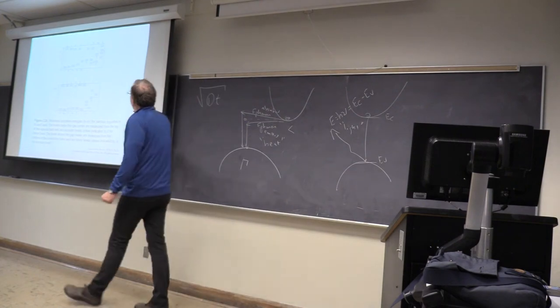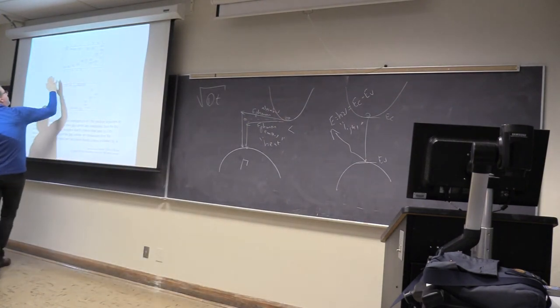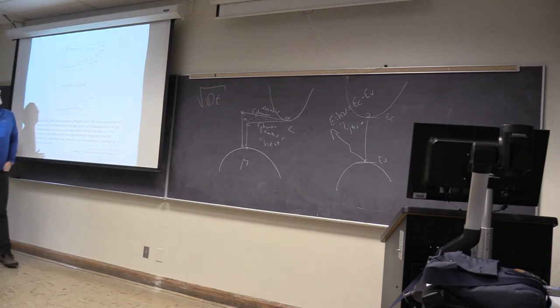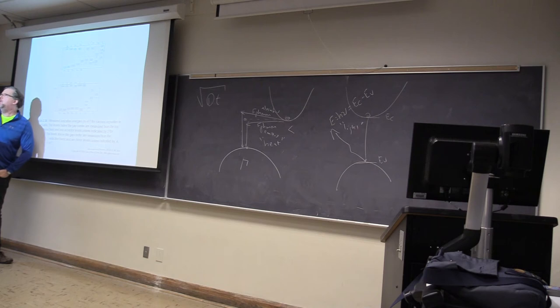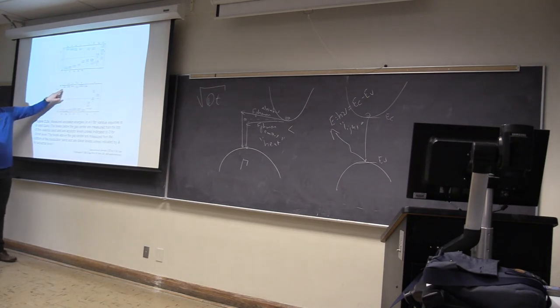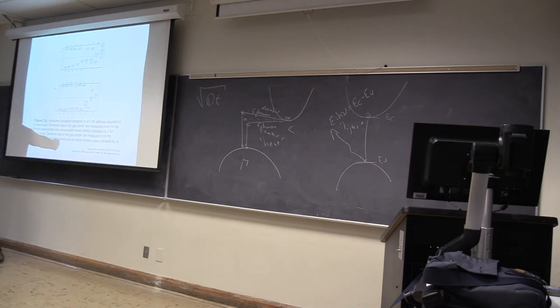What are the conditions for a preferred dopant? What do you say are some of the things you would look for in an ideal dopant? I don't know if I emphasize this enough. An ideal dopant, I would want this to be shallow, and I would want it to be able to, that I can put it in the lattice, right? The diffusion or implantation or epitaxy that I can put it in.